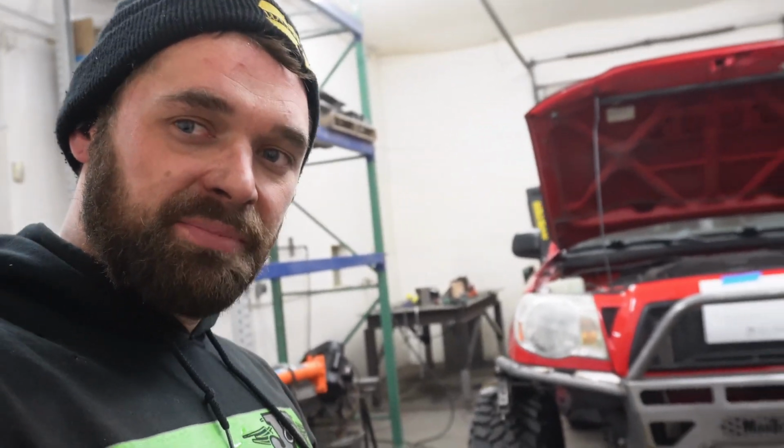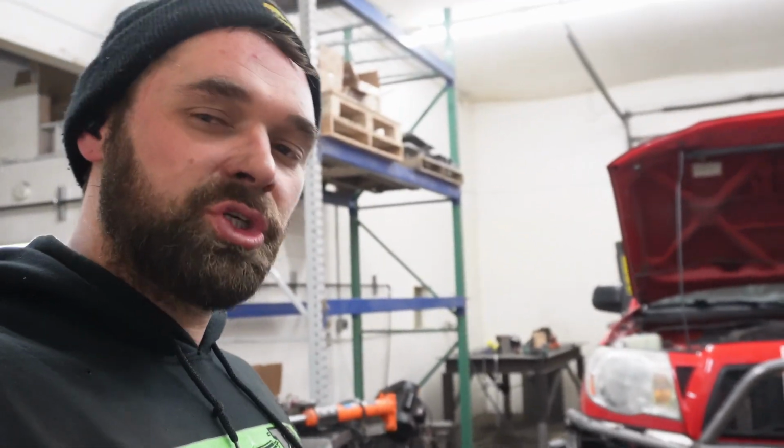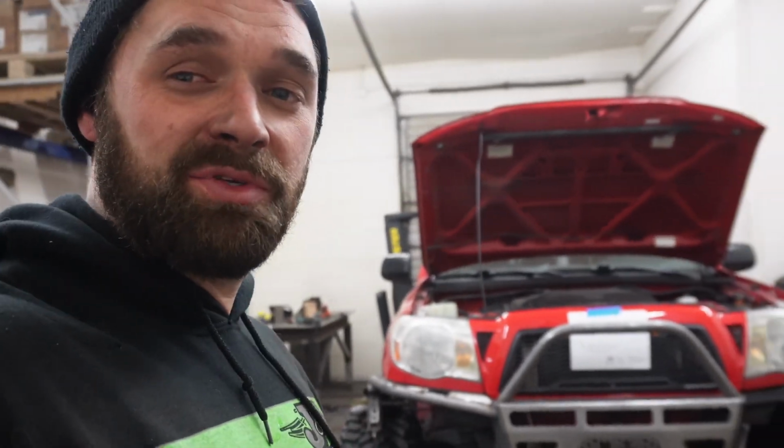So chip all the slag off of it, wire wheel it, make sure there's no scratches, no scuffs, go over everything I blended, make sure there's no damage that will show through powder. The stuff that's not fun. But the outcome is worth it. It's gonna be cool. See you tomorrow.